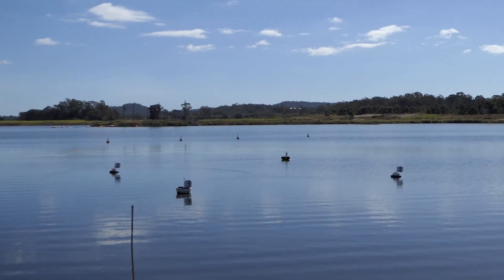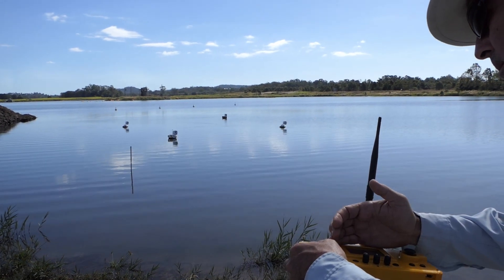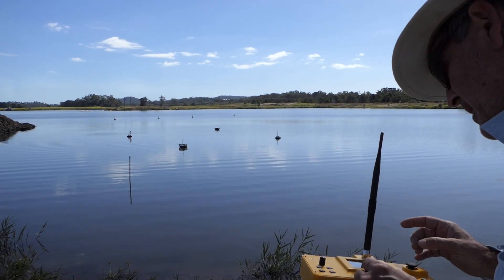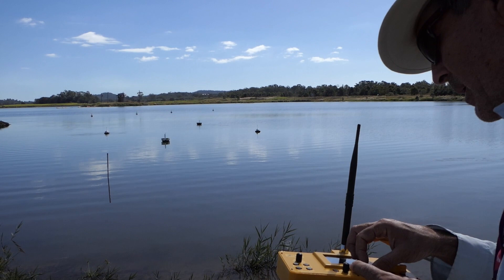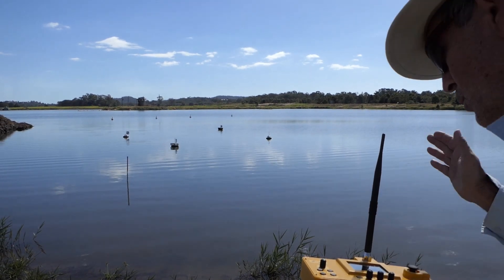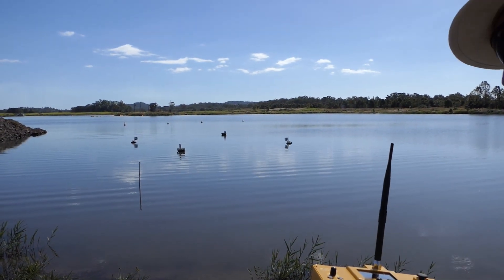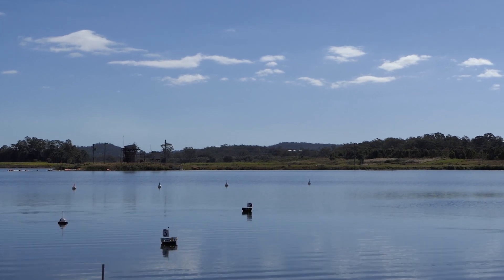If someone said we want to move the whole course off the bank, I can go to number one. You've got to be very deliberate with this process and give it time — there's a lot going on; they're talking to probably up to 20 odd satellites. Now I'm going to tell number one to move. I have an option to move anywhere between 5 and 100 meters, so I'll move this buoy about 10 to 15 meters in a northwesterly direction. All these buoys are tied together, and they're tied together around number one.